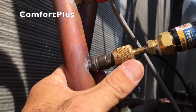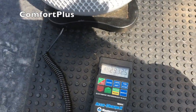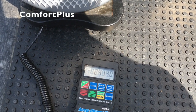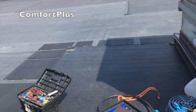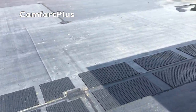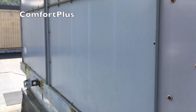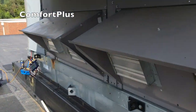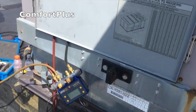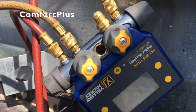She's been off for 30 minutes while I was screwing around with everything else, but I took my hoses off so I can crawl in here and get my refrigerant put in. I usually take my gauge off when it's running, but since this one was kind of in the middle of the circuit I didn't want to let that much in. I had her under vacuum and opened up the valves on the gauge and it took 30 pounds. I've turned the high side of the gauges off and turned the disconnect on — the blower fan is running.